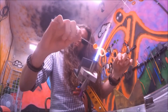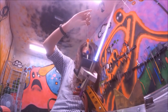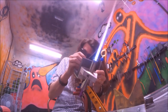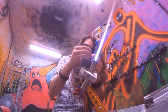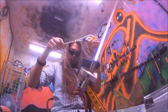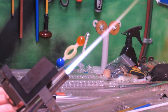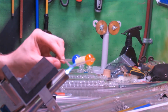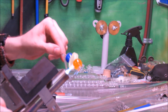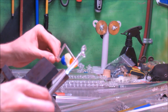Attach the other arm the same way. Once everything is centered, we are going to use one punty to bridge to the other, making sure to work in the connection with a small flame. Work in the connection on each arm. Testing the bearing after each arm to make sure it still fits. If not, you can use a reamer to open the hole up a bit, making sure not to distort the wall thickness.